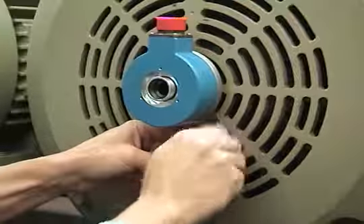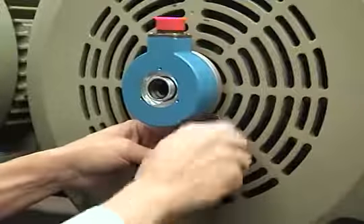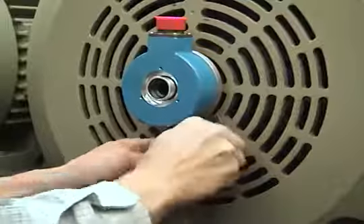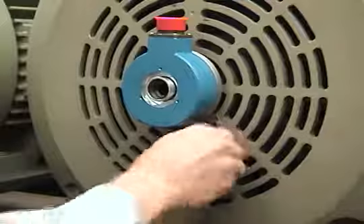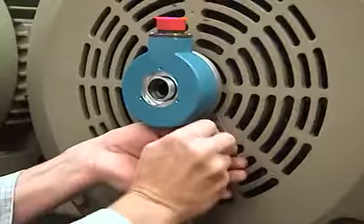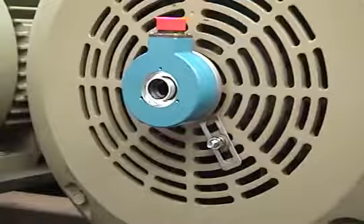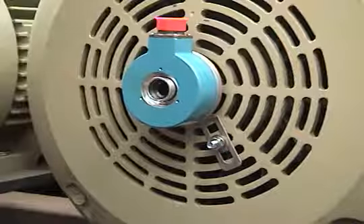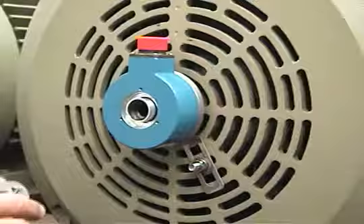To prepare the arm for mounting, snap the plastic washers together around the anti-rotation arm. Secure the free end of the anti-rotation bracket to the frame using the nut, flat washers, and lock washers included to secure the tether bolt. The arm should be flat with no bend or deflection. Use additional washers as needed to install the bracket without a large deflection or bend.